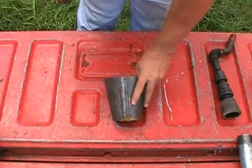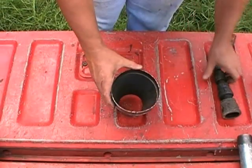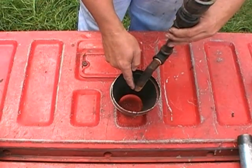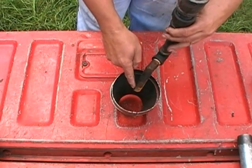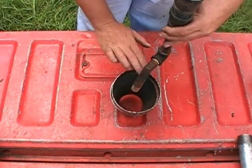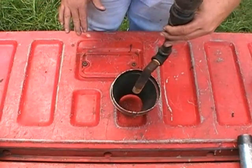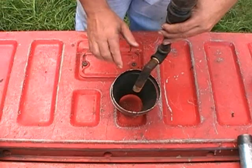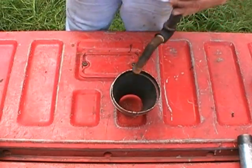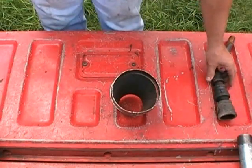What I realized was, let's set this guy right here where he's going to be going, when that air nozzle sat down, he protrudes an inch. I said 2 inches, I think, in one of the videos. It's really an inch. When it sits down an inch below on here, as long as this is covered up with wood, at least level with the top of this, flush with this, you'll see very little smoke inside of the hopper. You won't see smoke filling the hopper until this thing actually starts running out of fuel. That was just a good accident that I discovered. It wasn't on purpose, it was just something that I stumbled across.